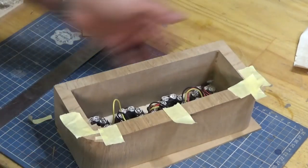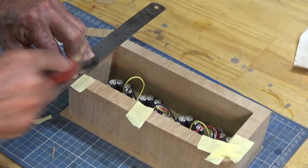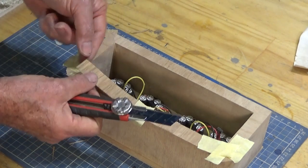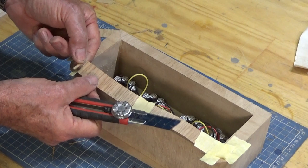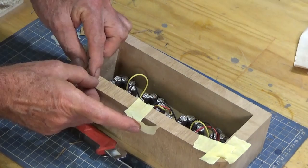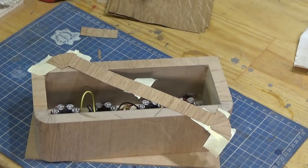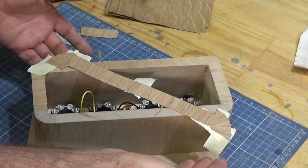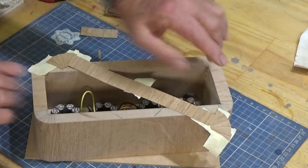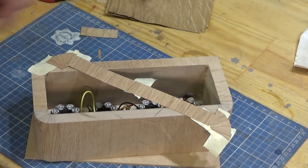Okay, same here. And there's the waste piece off the bottom. Tape that one together. Well, there's the piece taken off now, and what we have to do is get that back on again. So we're going to wet that raw edge of the MDF with glue, carefully register the two cut ends with the existing cuts that are already there, get it all clamped down.